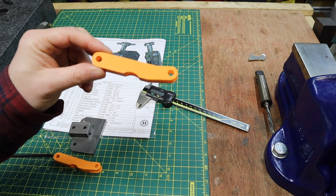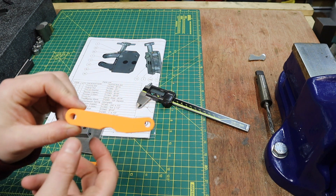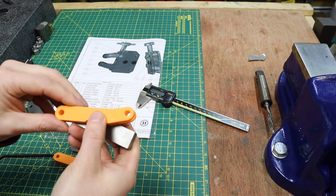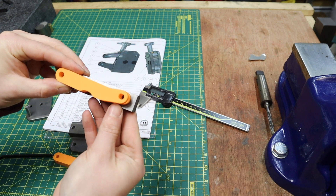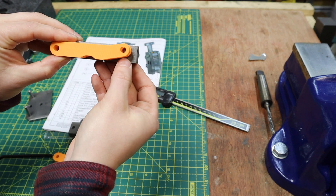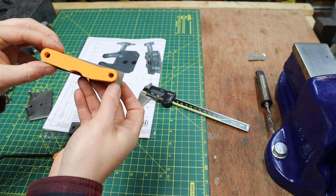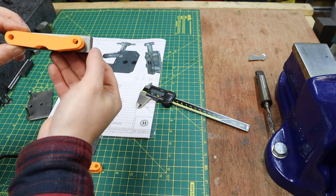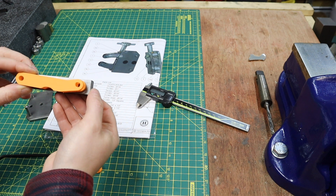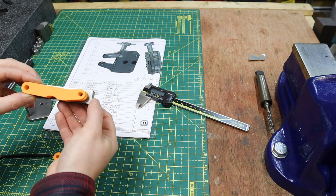This is what the overall arm needs to look like once it's all finished, and to get to this point we're going to be starting from a piece of raw bar stock. This is going to fit on there but it's going to require a little bit of machining work. There are a few compound angles we'll have to do, and to begin with there's a little bit of material that needs to be removed on the end, so I'm just going to use the band saw to remove the bulk of that material.